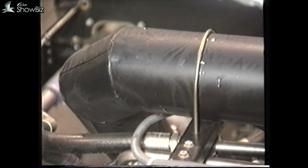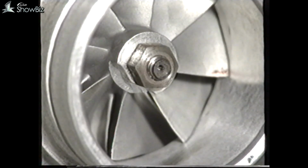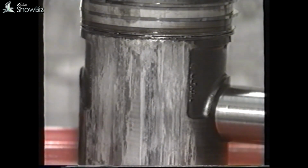Be aware that the smallest of holes will allow dirt to be drawn in large quantities, causing damage to the turbocharger compressor wheel and increasing wear rate on piston rings and liners, rendering the engine unserviceable at mileages as low as 10,000.